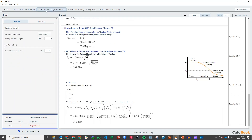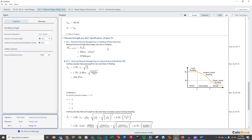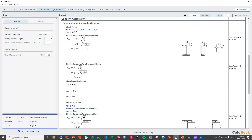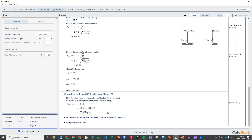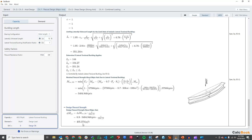Then we can move over to our flexural design. The only thing we need to enter in here is the unbraced length — we're just going to use that height, which is 12 feet. We're not going to make any adjustments to the buckling modification factor because that doesn't apply for this column. We go through each of the calculations, check our slender elements for the flange and the web, then step through and check our capacity for bending. That is controlled by lateral-torsional buckling, and we have a capacity of 405 kip-feet. Our demand for the column moment is 97.4 kip-feet, giving us about a 0.24 D/C ratio — approximately 25% utilization.